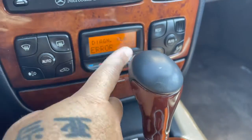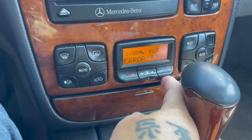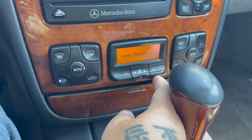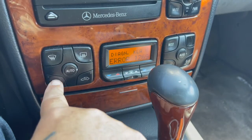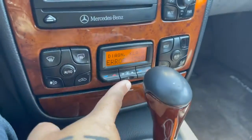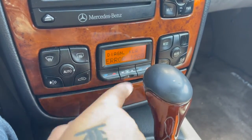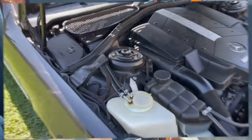So once you go through your menu and see what kind of error codes you may be having, you can go on this side of the unit and scroll through to see if you have any additional codes. We'll search yet again and see if you have any additional ones. All I currently have is this one right here. You hit this button right here, hold it down for about five seconds and it will search. This will pop up and you can scroll through and see if you have any other issues.